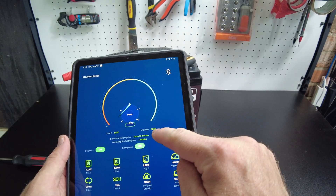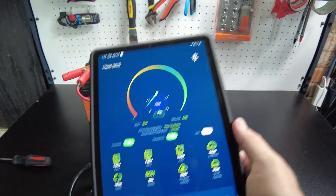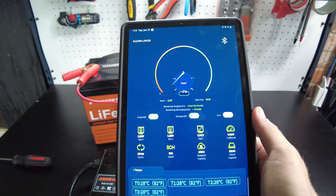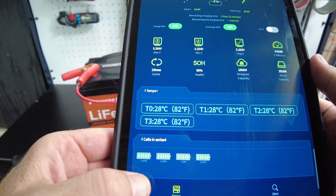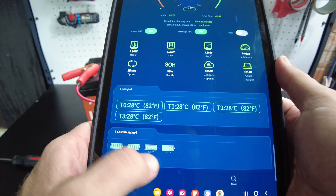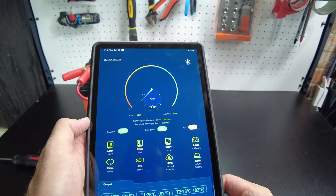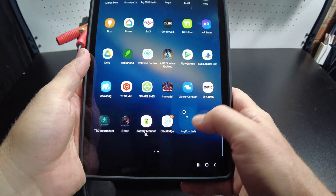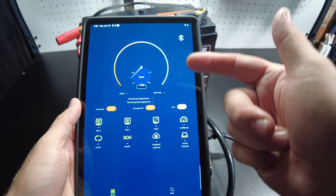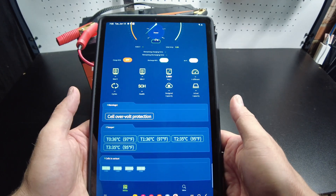It shows we're putting in 42.6 amps. Looks like maybe they cycled it once at the factory and didn't charge it back up. It's going to take two hours and 22 minutes to fully charge. Our cell voltages have risen to 3.265, pretty much 3.26 across all four. The charger stopped so the battery should be fully charged. One thing they got right on the app is it automatically reconnects to the same battery — you don't have to search a list. It goes right to it, which is really awesome.